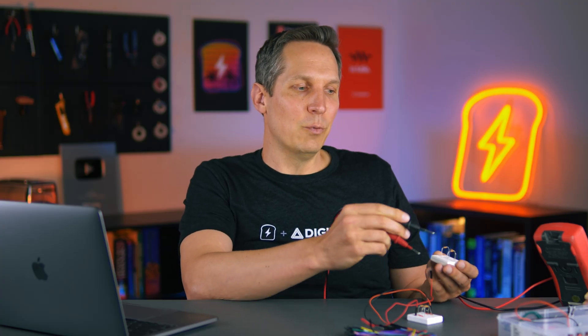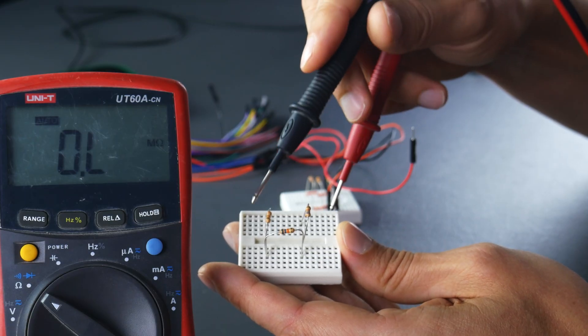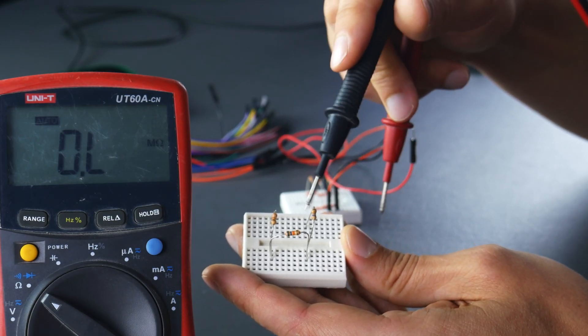So now we have seen that with these resistors in series, we get a voltage drop over each one — each resistor has a different voltage drop, and each node that the resistor is attached to has a different voltage. We've also seen that being in series, you can have a series equivalent resistance, so if you just want to pay attention to what the two end nodes are and the resistance you see from there, you can do that extremely easily. I think we are done with the series — now let's go over to the parallel circuit.